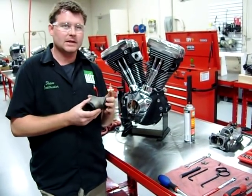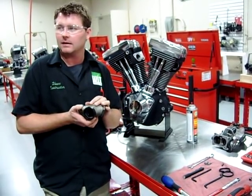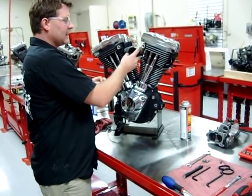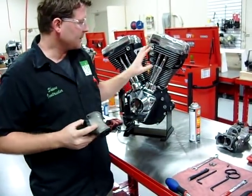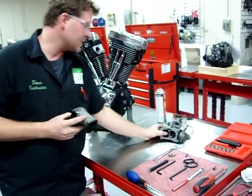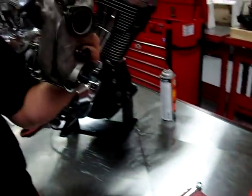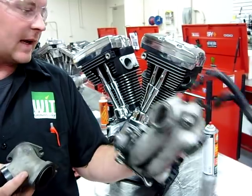This is a big source of headache for Harley-Davidson engines because it's such a place to create an intake leak. Due to the design of the V-Twin engine, to be able to squeeze this manifold here, we need some flexibility to get that down in that V. This bike here is an actual fuel injected one, so here's the throttle body for this particular motor, but what we see is the same style manifold with these flanges — there's nothing any different about that.